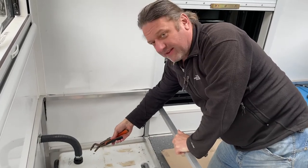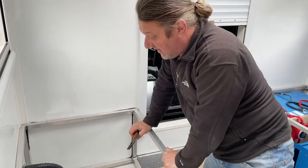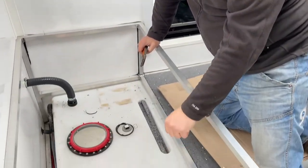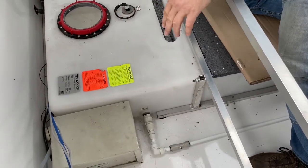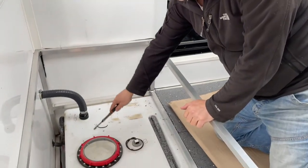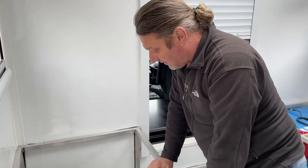So I am expecting a couple of leaks here and there on these type of things, because I'll just slightly nip them up until they are completely watertight. The other ones, like the John Guest plumbing fittings that are push fit with O-rings, I'm not bothered about them. They should work straight out the box. But the likes of this, and this kind of thing, it's a nice gentle nip up so you don't damage anything. Try again.